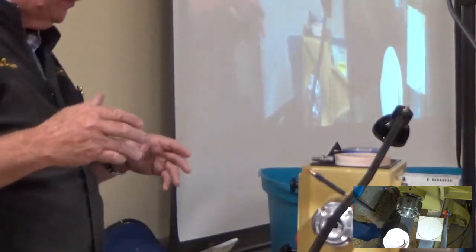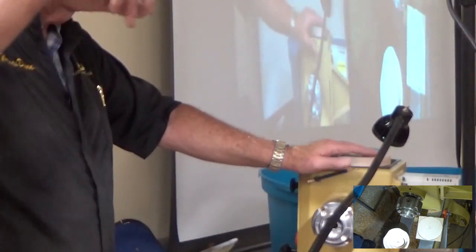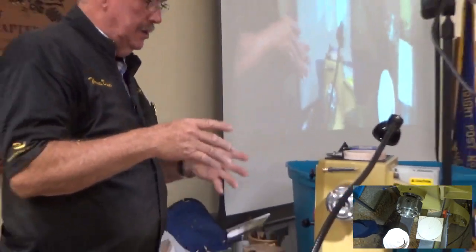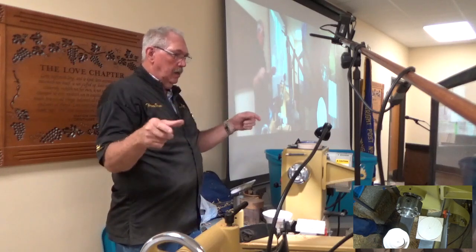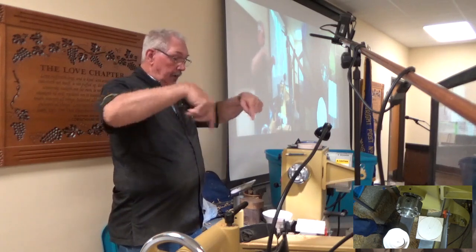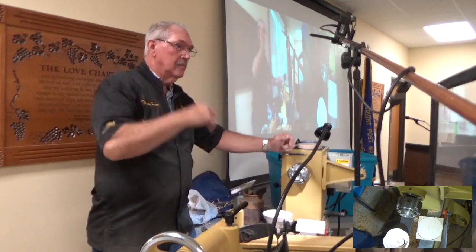Now the one that looks like stair steps, that's segmented, but it's the same way. I just did one flat segmented ring, 24 pieces in a ring, where the segments go all the way almost to the middle. Then I cut the rings out of it, and then stacked them up and turned them.